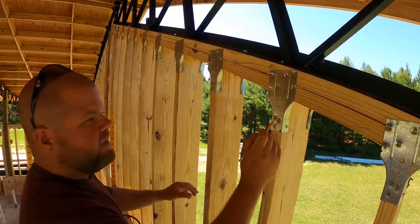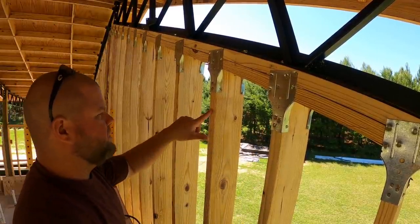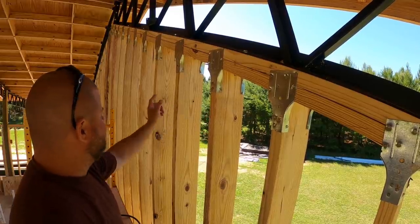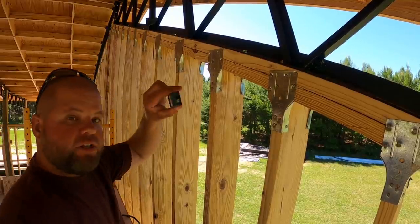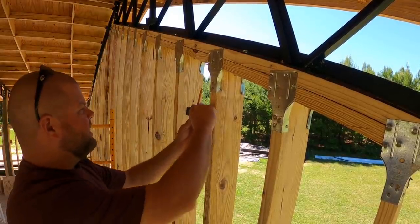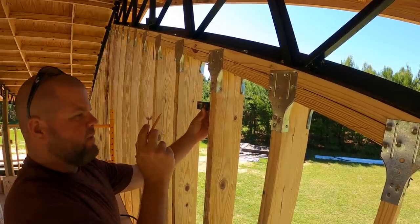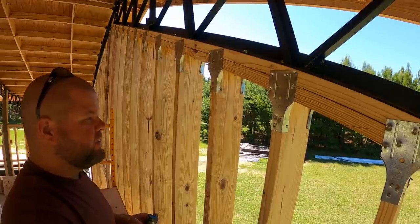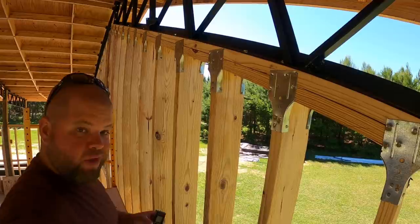Okay, so you can see, maybe you can see by the camera, we have our chalk line snapped all the way across. Some lines are a bit light, but pretty easy to see by eye. So what I want to do is just verify that that is exactly 12 foot down. It's very easy to do with this now. And I'm also thinking I can use this now to quickly shoot over and get my measurements, and I'm going to double check everything with the tape measure. But this may really, really speed my process up on figuring out blocking, stud length, everything else. So let's check.